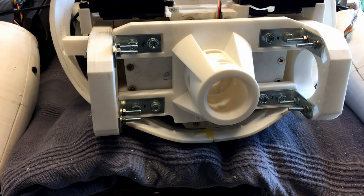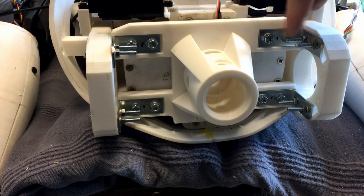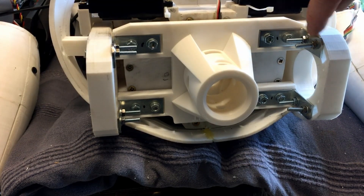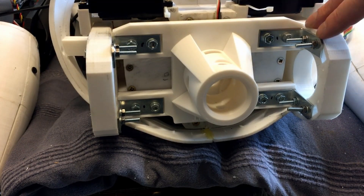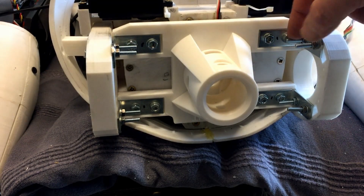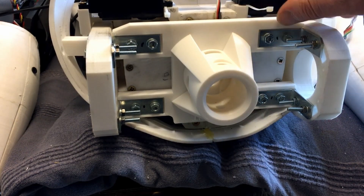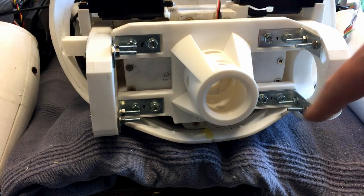It's just a close-up. I've got the bracket now mounted on the base of the InMove. I had to file down just these corners slightly because they were sticking out. These weren't particularly accurate — these L pieces I bought from the hardware shop. Out of a packet of ten they varied in hole position and diameter. But I managed to get the original one I measured, and managed to get them all in.